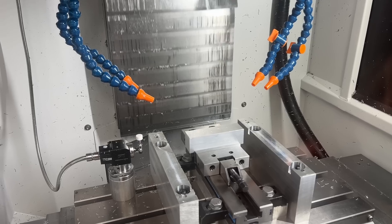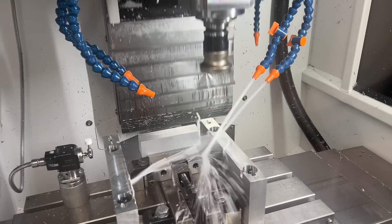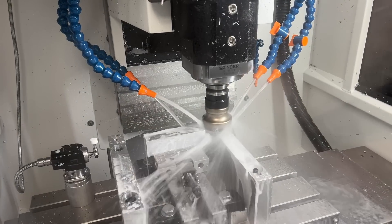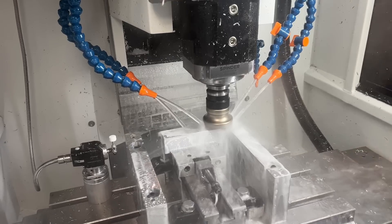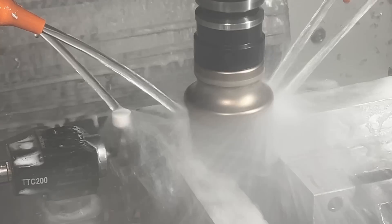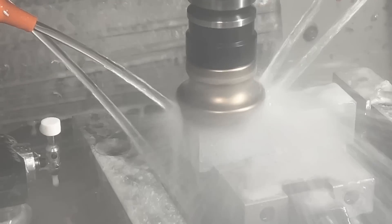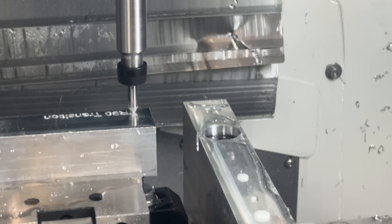You may notice that slight love tap on the vertical slideway covers — probing error plus being an overconfident idiot caused that. That's a 63 millimetre end mill with only two inserts; I'm using it as a sort of wildly over-engineered fly cutter. So now I've got the stock faced off, it's time to do the engraving.